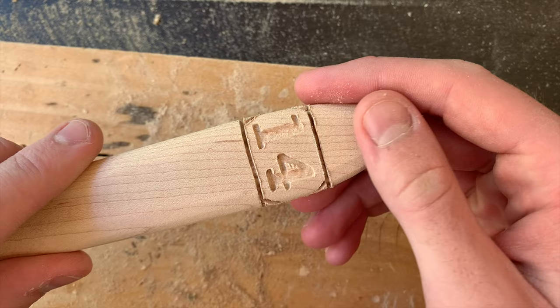After that, I used the Dremel 84922 at 10,000 RPM to grind out any little imperfections along the spoon, including the insides of the slits and the base of the number. Then we're all set to finish the sanding. I soaked the spoon in some water for a few seconds and let it air dry a couple hours in the sun, then sanded it with buffing wheels up to 400 grit. I repeated this 3 or 4 times because if you don't raise the grain and re-sand it a couple times, the first time you use this thing the finish will look awful — almost fuzzy — so really don't skip this step. I finally sanded the whole thing with 1000 grit sandpaper just to bring out a little more of its natural luster.